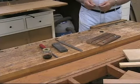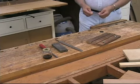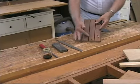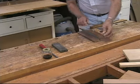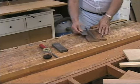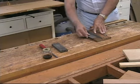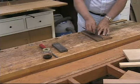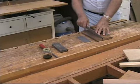I'm going to show you how I sharpen a hand scraper. There are several different ways to sharpen them. One of the things that I used to do, which I don't do anymore: this fixture has a slot where you can place your file, and normally it's good to place it at an angle. This is to get the surface smooth and flat. You can put your scraper along there and do that. Of course, the first thing we're trying to do is get rid of the old burr. Okay, I don't use that method anymore.